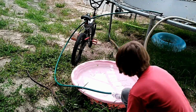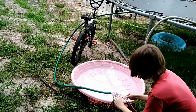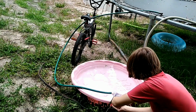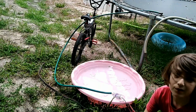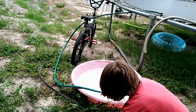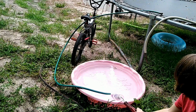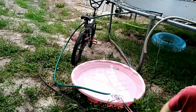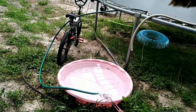So, I actually have this motor wired backwards. So, I have to connect it like that. Then I can wrap the heat wire around. I'm going to be powering it through a heat wire because when I was testing it, the motor heated up a lot if I needed full power, so I'm gonna have to resist it a little. Okay, so that's on low power.